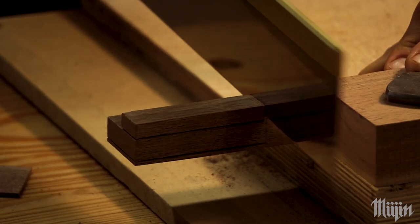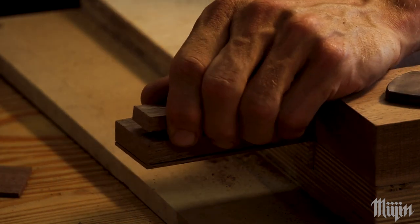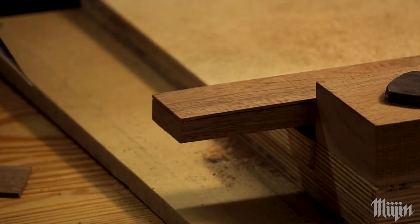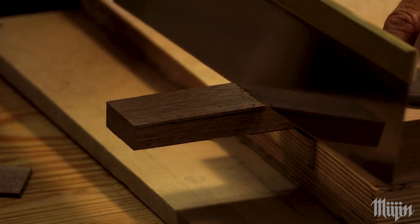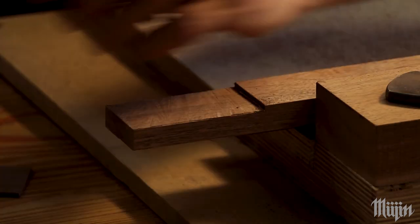When it's all put together, these rails are going to stick right out of the legs. Don't worry, it'll look good. It does mean long tenon cheeks with narrow shoulders, though. Eventually, we'll dig some holes and drive wedges through the protrusions.